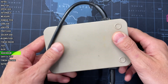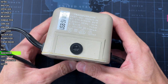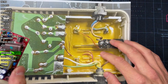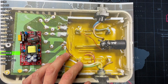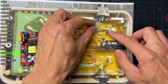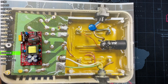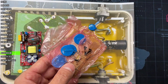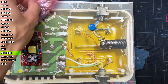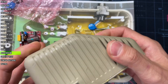So it's now the next day and the power supply is firmly glued shut. However, while I was fiddling with another power supply for one of the future projects, it occurred to me that I could easily have placed a varistor between the neutral and the live wires of the mains power, which would have added an extra layer of protection — especially because I have a bunch of them already laying around the chicken farm. But unfortunately it's too late now; I'm not going to unglue it. So maybe next time.